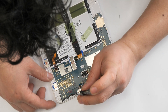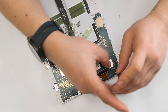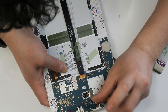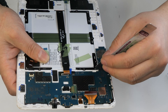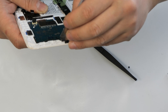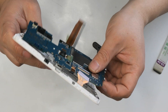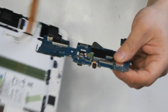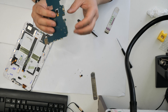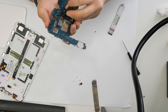There are about six screws holding the motherboard, so you remove them as well. This one has some clips to hold the motherboard — normally I would not use a metal prying tool, but in this case since I have to unclip those, I am using it. All together there were six screws. This is the front-facing camera — let me remove this camera as well, and the main camera, so that I don't burn it while removing the charging port.